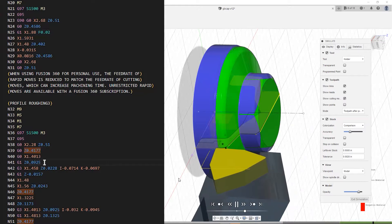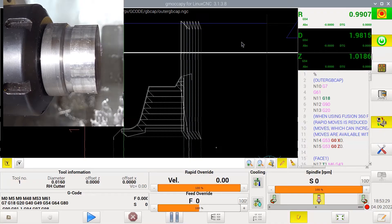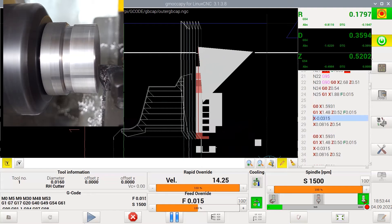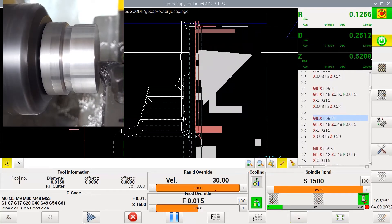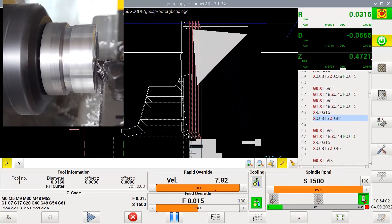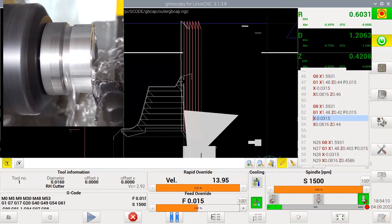Once I got the program onto the machine and tested on some already somewhat scrapped parts, I found more changes needed. Specifically, my stock is actually longer than I told Fusion 360. Also, there's a G61 at line four that I added because it was cutting corners on the finishing pass. I've added manual facing passes to bring the stock down to a standard length, because these are bandsaw cuts and the billets were originally made 15 years ago. We do the initial manual passes and then it goes into the actual Fusion 360 facing pass.